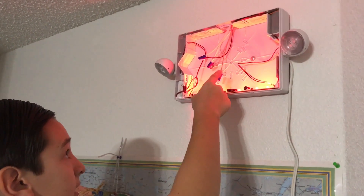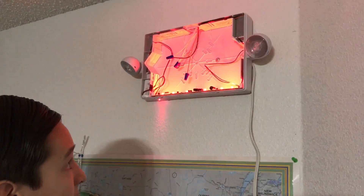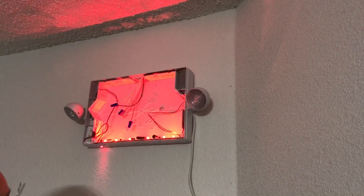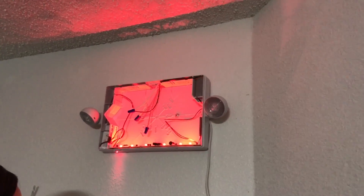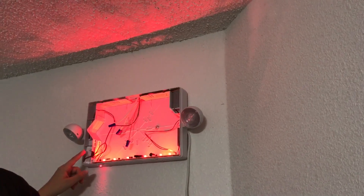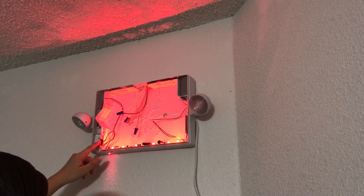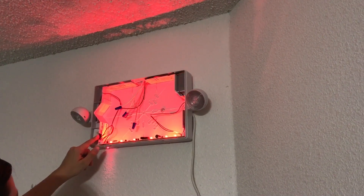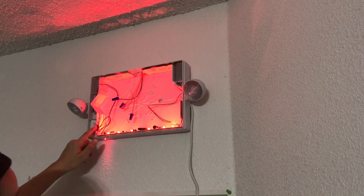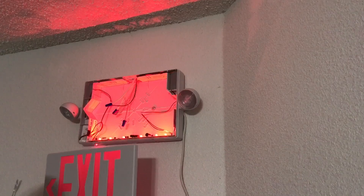On the extension cord, the smooth wire is hot and the rough one is neutral. This orange wire, which I have capped off, is for 277 volts — in some big buildings they have multi-stage power systems and those units would be run off 277 volts. Also on this specific sign, I actually had to put a piece of electrical tape to hold the battery cable down because it would always pop up.